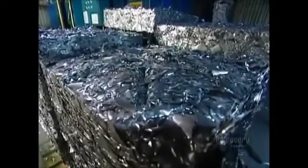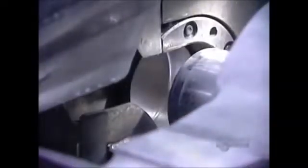What's left of the sheet gets compacted and sent back to the aluminum factory where it's recycled into new rolls. The cup goes into a machine called the draw-and-iron bodymaker. A tool draws out the aluminum, forming the body of the can. The tool is lubricated so it won't tear the aluminum while stretching it. The lubricant also acts as a coolant because the aluminum heats up as it's being worked.